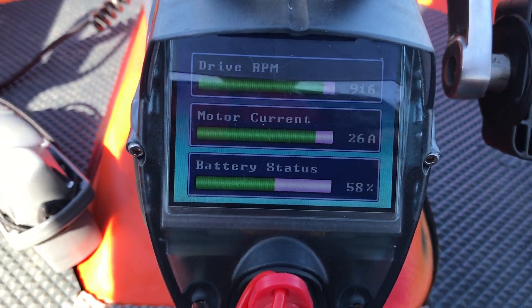That's a cool speed right there. I would probably say running it at about half throttle — so you're not pushing up against the boat's hull speed — would give you a lot more battery life. Just turning it down about a third, maybe cruising at three and a half miles an hour, brings the motor draw down to about 60% as opposed to pushing at that 100% range.